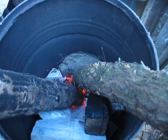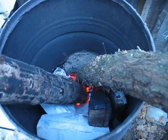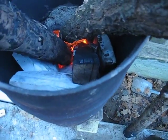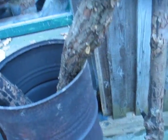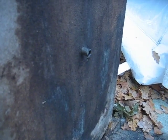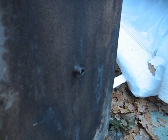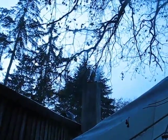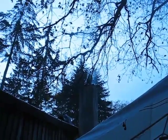Now I put a leading edge — an insulating leading trough — and it's pulling with hardly any smoke coming out of the top now. It's directing combustion much more down the fire, which is great. The fan is still on. The condensation we need to measure later but it looks pretty good, not a lot coming out compared to before — we had this completely wet floor. The exhaust up the stack is still pretty smoky but that could be a lot to do with the wet clay. I've just built the housing for the rocket stove.